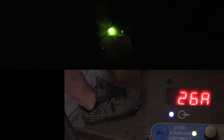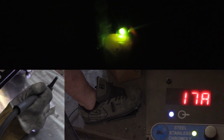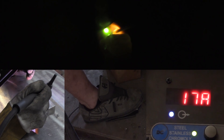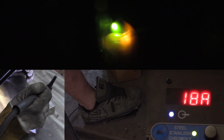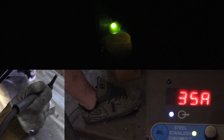Now you notice that my hand is making the circles and I am feeding filler rod, but as we look under the hood here, you can tell the machine is kind of dancing around a little bit. There is some heavy on the amperage, low on the amperage — that is all being controlled by my foot to actually increase or decrease the amount of amperage. My hand is still making the circles, the rod is feeding in there.